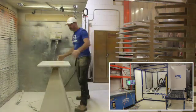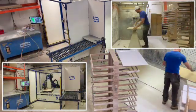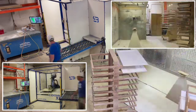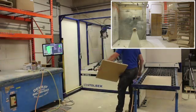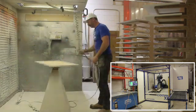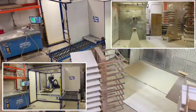Watch close as this door gets sprayed — that's the front side of the first batch of doors. All that dry time we were trying to avoid is actually an illusion because it gets absorbed into the sanding time. The doors I'm now spraying the front side on have already been sitting for 30 minutes, so they're dry. The bottom door in the rack is soaking wet — that's the big time difference in batch processing, punishing the first door and supporting all your activity to the last door in line. In single piece flow, I'm able to get the door sprayed on both sides in the same time the hand sanding is happening.